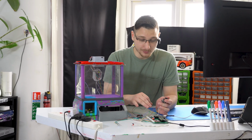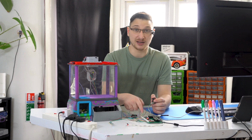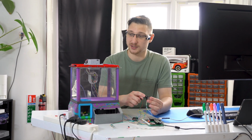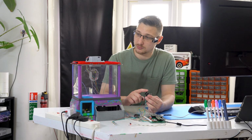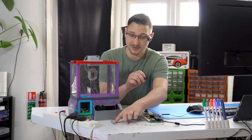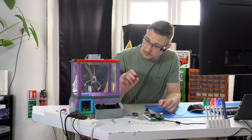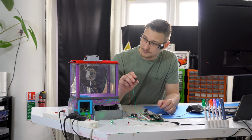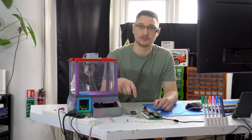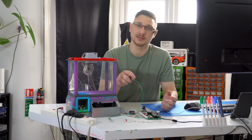I've got the code running on both the Picos. It's still in very early development because there's supposed to be a coin slot, which I don't even have connected yet. That actually starts it going, but for now it just goes from the get-go. So I have control of the gantry right there, and then this button will play a sound effect and some lighting effects and deploy the thing. So theoretically, if I go... and the sound kind of continues for a while because it's just going through all the GPIO pins. At least I know they all work.